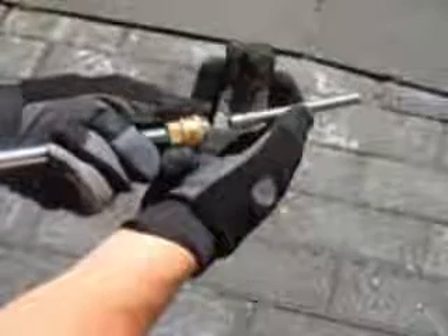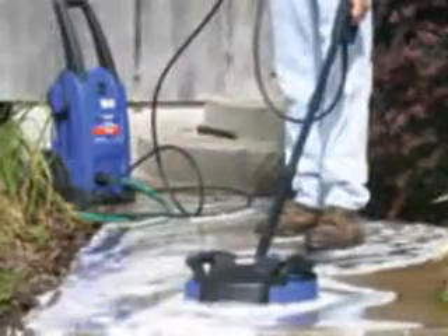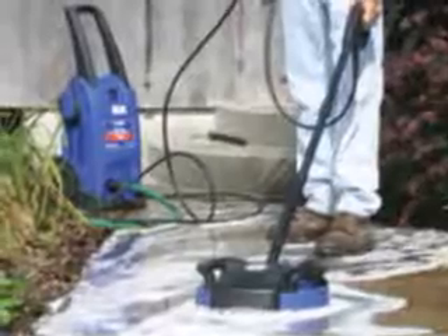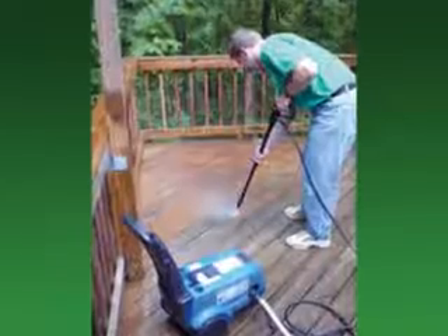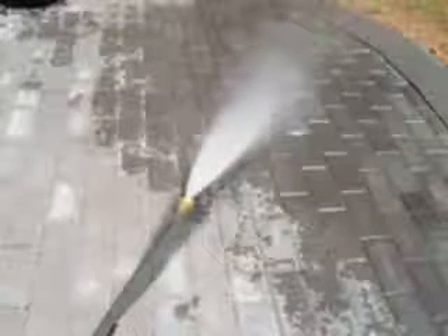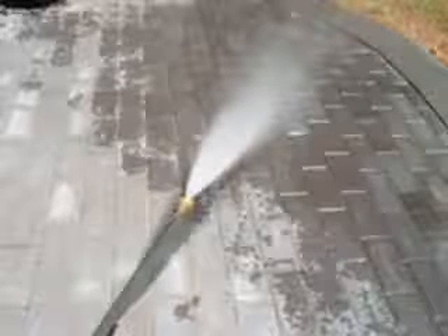The fundamental setup of a power washer can blast away all sorts of dirt and debris using the water jet alone. But for more cleaning power, use a cleaning solution. Most pressure washers include an injection container that mixes a cleaning agent with the jet stream. The rule of thumb is to make sure the label is marked 'Approved for Pressure Washer Use.' The right nozzle also makes a big difference in washer performance. Some nozzles spray a fine fan of water for easy coverage when spraying a cleaning agent. When you need to blast away stains on concrete, switch to a zero degree nozzle, which shoots a concentrated jet that can cut through stubborn dirt and discoloration.